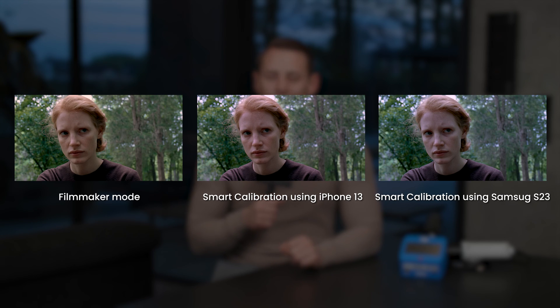The customer gets a unit like ours, where color reproduction is not far from perfection. Then he attempts to get the best out of the device and decides to use the built-in function, after which he gets completely ruined color reproduction — and at the same time a report in the app saying that everything is okay and this is how it's supposed to be. Why is this happening? First of all, analyzing graphs and choosing the optimal calibration method requires a lot of knowledge, which is not easy to encapsulate in the algorithms of built-in functions. For this reason, any automated calibration mostly either doesn't work properly or involves a lot of compromises, as we saw in today's tests.